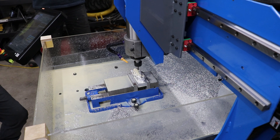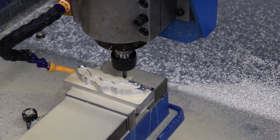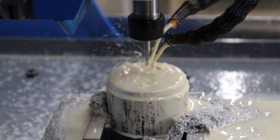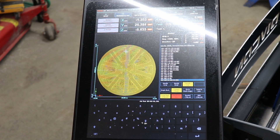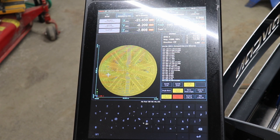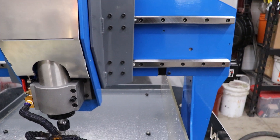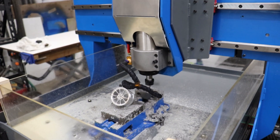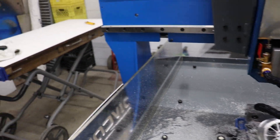I'm trying to play around with some of Fusion's toolpath options, as there are a lot of them and at this point I don't really know what's best to use, so I'm trying a little bit of everything. After we completed our mini caliper, we moved on to a little wheel. We're running some smaller tools on this one to try a little bit more detailed mill. Nothing's loosened off — good and stiff. We were checking for play today just with a dial deflection gauge and even when we're reefing on it, it doesn't move, so happy with that.